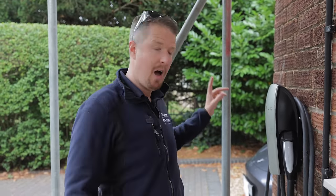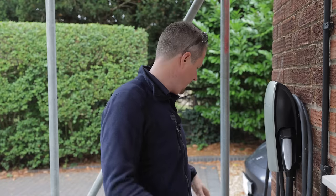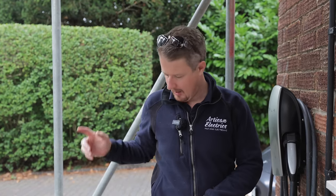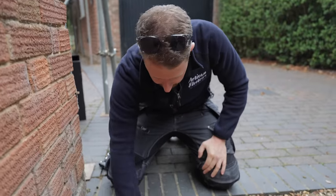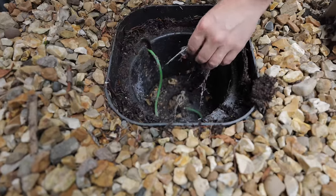We also fitted an earth electrode and earth rod in the driveway because this doesn't have PEN fault protection, so it either needs a PEN fault protection device or an earth electrode for the charging point. I'll quickly show the earth pit because I'm curious how well it's aged. We're also going to get the gen 3 paired up to the wi-fi first, because that can be a bit of an issue — you might have seen my previous video where I said the gen 3 was the worst EV charging point ever. I feel like Indiana Jones uncovering this old earth pit.